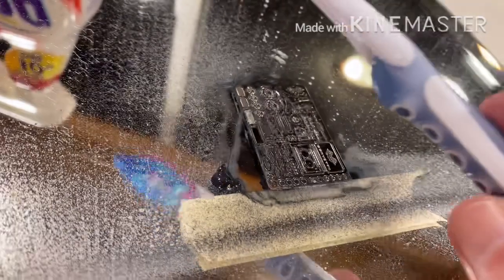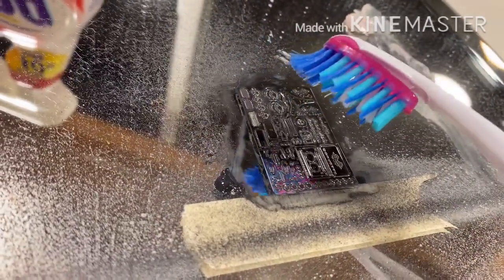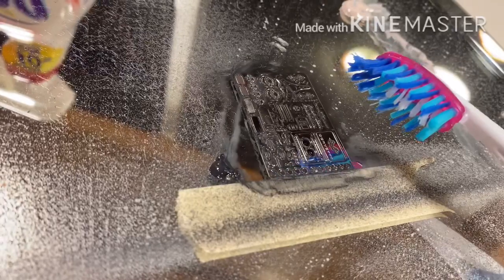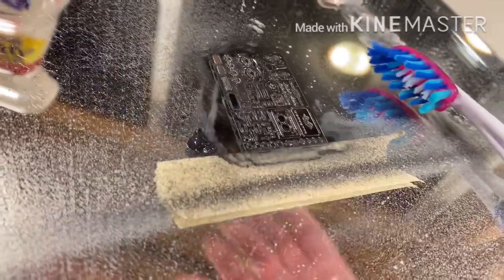Now that you've made a little bit of a mess on your bench, I did forget one thing you'll need: a soft toothbrush. You can use an old one or buy some inexpensive ones at the Dollar General — it's the only thing this will be used for. Take your 409, a couple of sprays, and gently just get that mess out of there. We're just gently getting all that black residue — that nickel alloy debris from the polishing process — out of those little nicks.